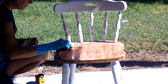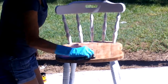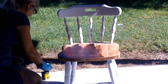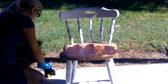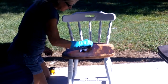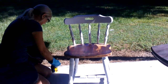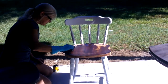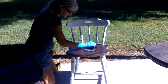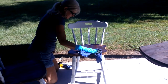The seats of the chairs were a different type of wood — it was a lot lighter and I needed to match the stain. I started off by using the same color that I used on the table, then for my second coat I went back and used a darker color. There are several ways that stain can be mixed and matched, and for this project this is the way I chose to match the stains — and I think the colors matched pretty well.